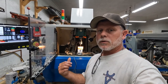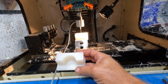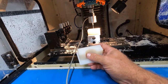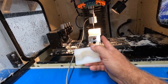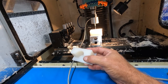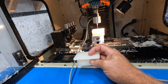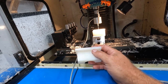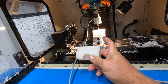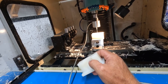This is the first completed piece — well, the second one. It's done in stages. I'm going to machine all of them to look like this first, then flip them over to surface off the excess material, and then rotate and set them in the vise to bore the holes for the bolts that lock it in place. I've already got my probe in and the part probed.